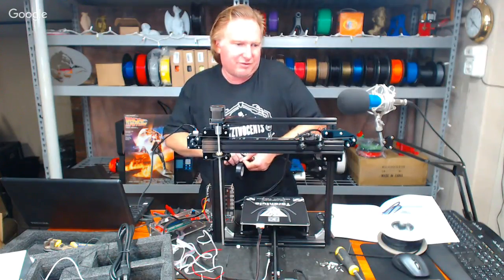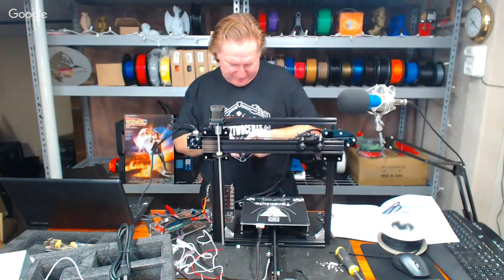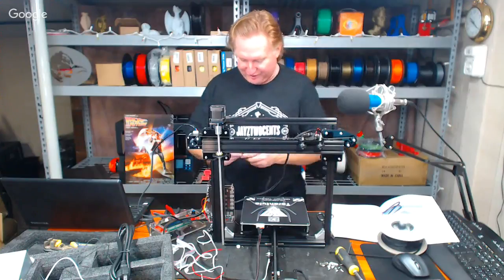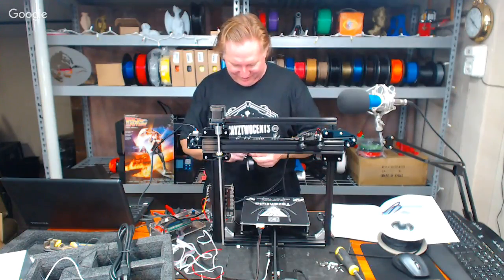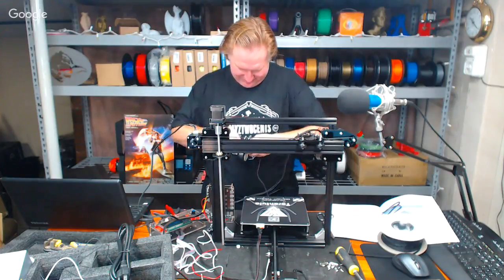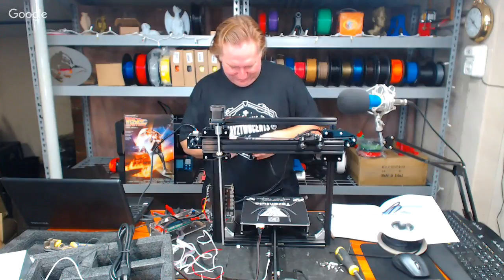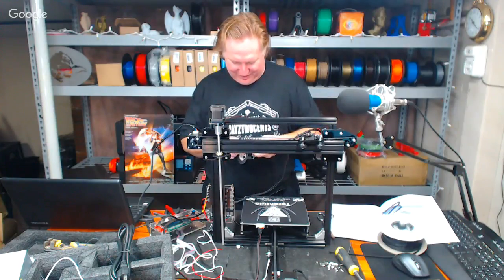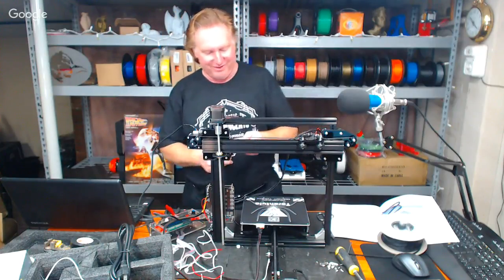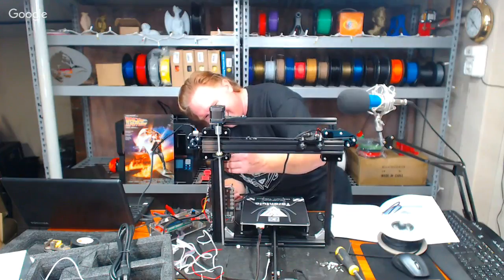Tinker Corner, I've designed printers with Bowden extruders, and man, even having the tube be slightly too long can give you the world of trouble. That's interesting. I honestly never gave any thought to the Bowden tube, not until I started messing with this. I tried doing a color change mid-print, and that was an ordeal. I was so used to using a direct drive, where you can kind of change color on the fly, just cut your filament and feed it in as it's going, especially when it's doing the infill, because who cares if there's a blob in the infill? When I was doing it with that, I cut it and I'm like, wait a minute, I can't do it like this. It just turned into a nightmare.